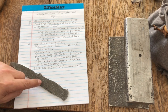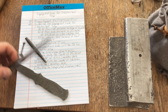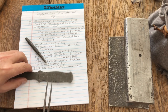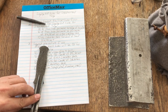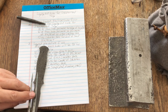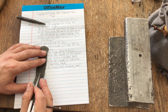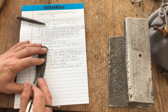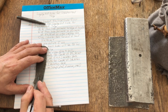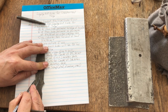So where on this line is the center punch going to go? Well, I am lazy, okay? And I like to do things simple, or at least as simple as I can. So I can kind of guess where the center is using a pair of dividers. I will get pretty close, and with this side of my divider, I will lay that along the edge of my handle and scratch a line on one side, then I'll flip over and scratch a line on the other side.